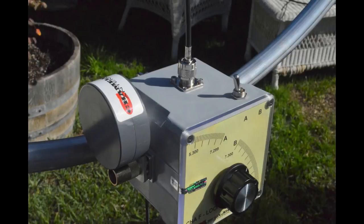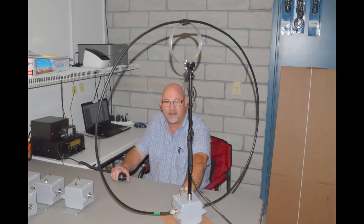Now on the bottom is the tuning capacitor. And well, he's got calibration lines as well as a toggle switch. The lines were not perfectly calibrated, but you tune that big knob quickly, and when you hear the noise really come up, that's your sweet spot. Now, for 40 meters and 60 meters, where Dale and I work U.S. Coast Guard Auxiliary comms, we flip the switch, and I believe that's going to add on to the left what is probably, it's supposed to be secret, a capacitor that adds more capacitive reactance to get us down there.